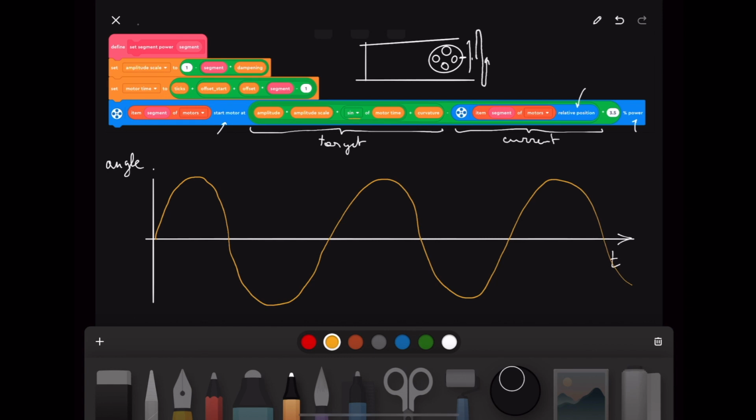That's why the sine here is a central element in the formula. And a sine wave does a full wave about every 360 degrees. So if we feed it degrees over time, you will get this sine wave. And I decided to feed it about 150 ticks or degrees per second. So if this is 150, right here will be 2 seconds. So it's 300 or 2 seconds.